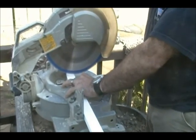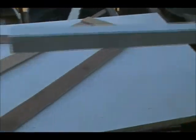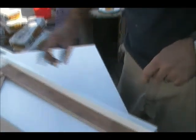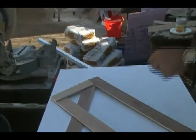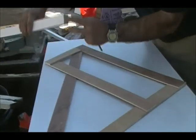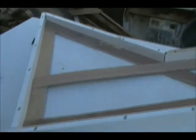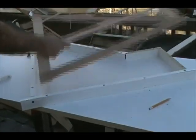I'm gonna lay that in like that and just follow this around. With these funky angles I have to establish what they are, because you can't put a piece like this and then try to put another piece up against it. You can't leave this exposed because what happens is when the concrete's wet and water hits it, it's just gonna want to blow up on you. We foamed up everything — fit, thank god. Now we're just gonna lift the foam out and all the padding out.